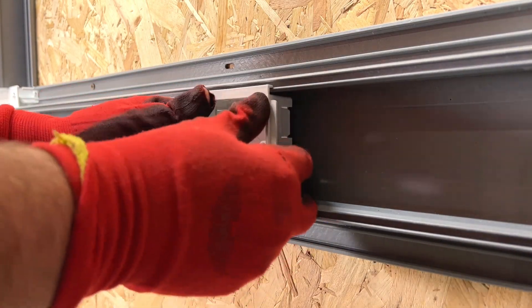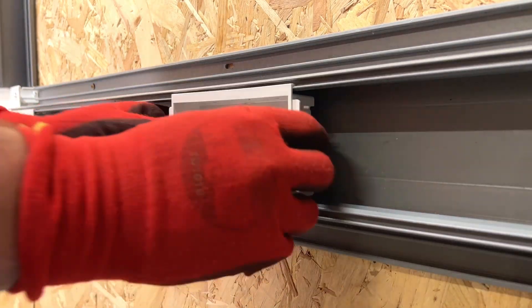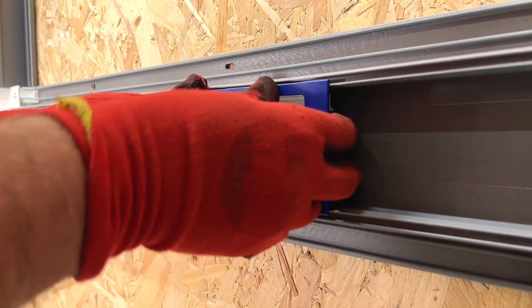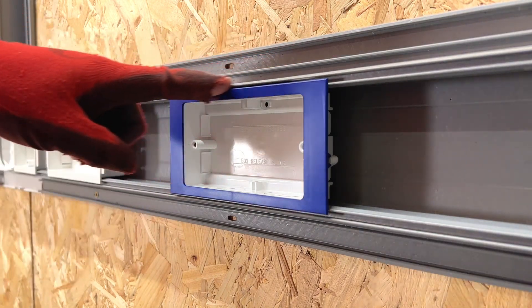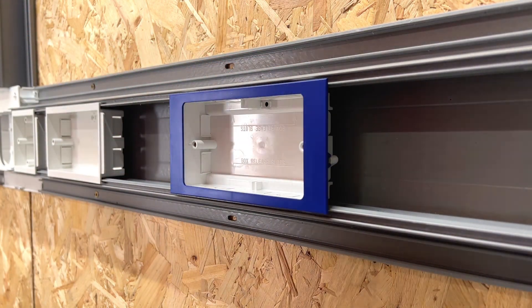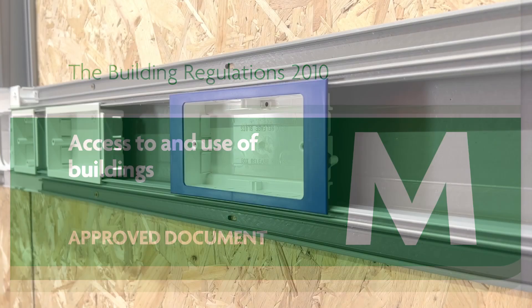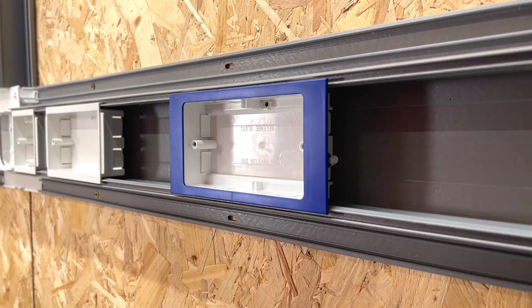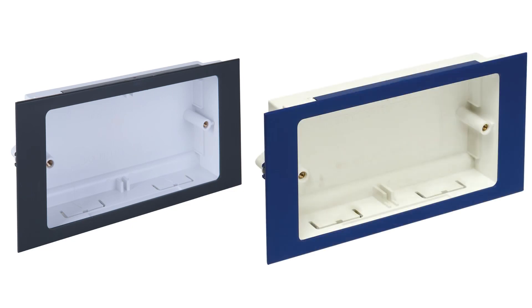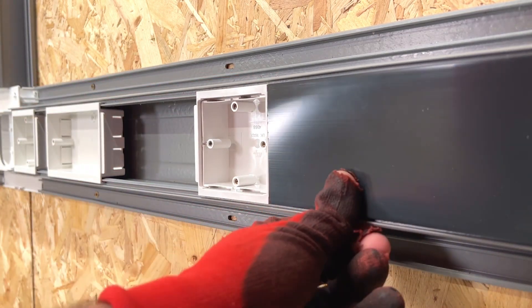Now let's talk about some of the stuff you can install into the trunking. There's the usual one and two gang boxes, but also some cool variants including ones with a darker colour surrounding them. When a white socket is installed, this creates a high contrast between the socket and its surroundings as required by Part M of the building regulations, which deals with access to and use of buildings — making it easier for partially sighted people to locate socket outlets. The Stirling range offers charcoal and blue box surrounds and spacers, and you can also get a charcoal coloured lid for the central section if you want to maintain that run of colour throughout.